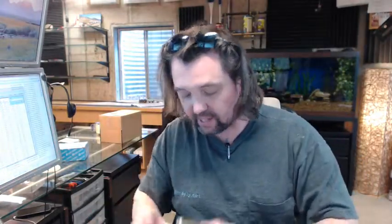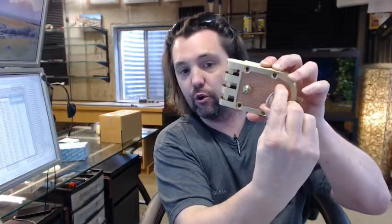The lock body itself features a spring-loaded hold back. In order to open the door — whether it's a garage door, side door, or basement door — you've got to turn the spring-loaded latch. If you're coming in and out with groceries and don't want to leave the door open in winter, there's a hold back feature with a small pin. You turn the thumb turn, depress the pin, and it holds the bolt retracted so you can come and go freely. Pull the pin out and it re-locks automatically.